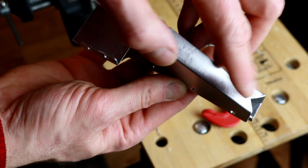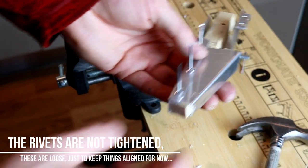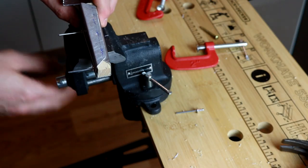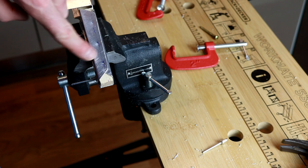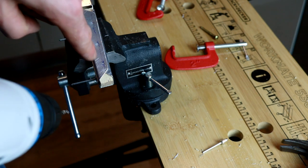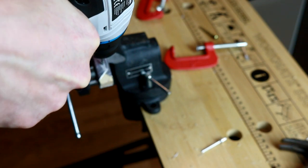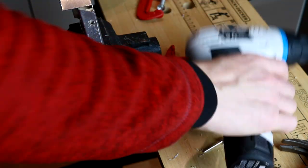Now we need to do the same on the top side - I need to make three holes on top. Back to the vise. Make sure the material you have underneath has enough going inside - if there's not enough overlap and you drill a hole, the rivet is not going to keep it tight. That's enough - we've got all the holes ready for rivets.